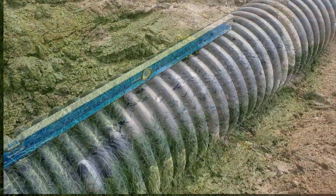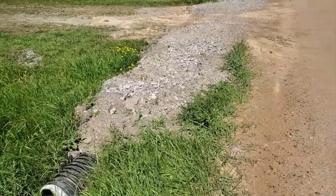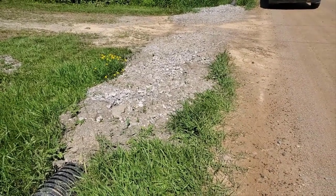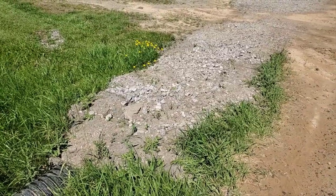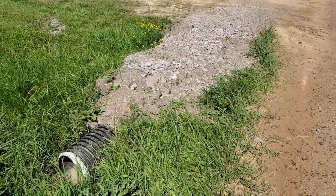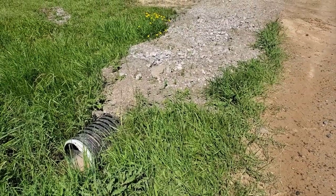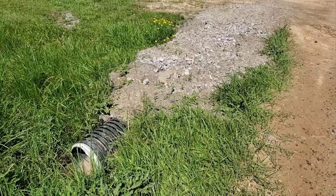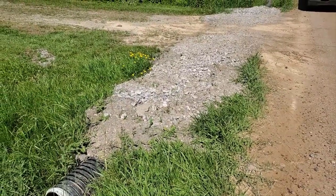In closing on driveway culverts: I bought this property from a good friend of mine. He put in a galvanized pipe — it wasn't in that long and I had to dig it up because it collapsed and rusted through. I put in another galvanized pipe, and in the last 25 years that's just not acceptable — two pipes replaced. This is the last pipe right here, a 12-inch dual wall heavy-duty sidewall that Boffman tile is known for. This material is rated to last 200 to 500 years.